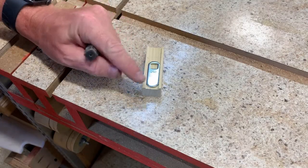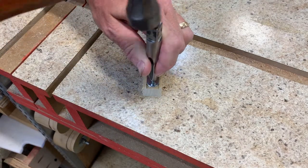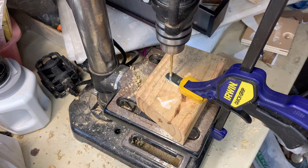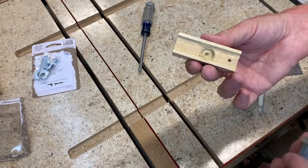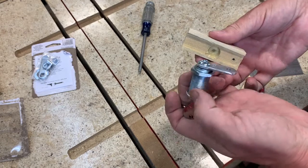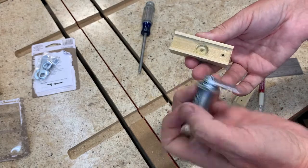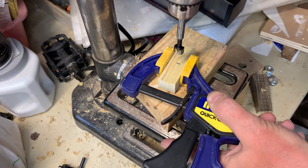On the lock arm, we need to drill a hole in it. On the prototype you can see I drilled a relief hole in the center, and that's for the screw on top of the lock mechanism so that there's some clearance there. We'll do that on this block. I put a half-inch Forstner bit in my drill press in order to drill the relief hole.